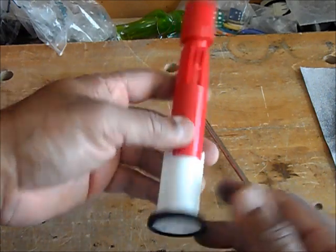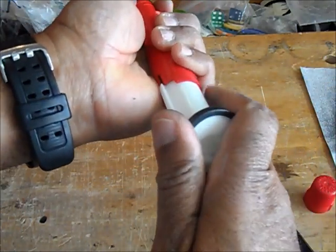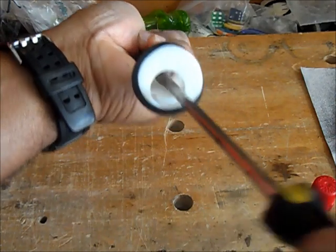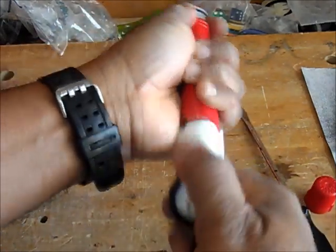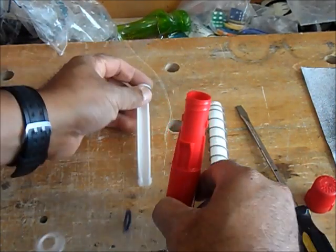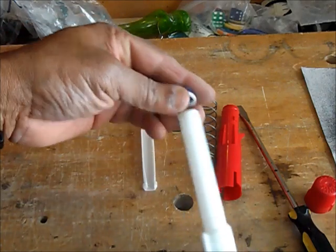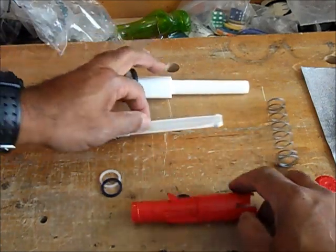All right, so first and foremost, remove the cap. You can depress it just a little so you can get your fingers on the top here. Stick your screwdriver into one side. I actually have the wrong screwdriver. And then the other, and you'll feel it pop right out. Did you see that? Great. Here's your washers, your spring, by the way, plastic first, then rubber. Okay, all that's important later in case you want to reassemble it for some reason.